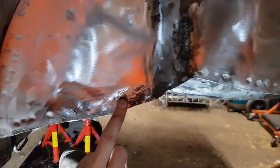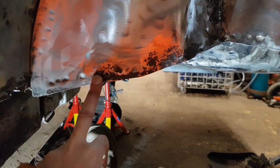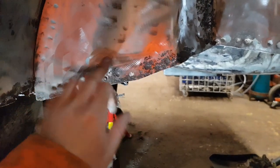I've still got rust up there to tackle. The flap disc does a great job on surface rust — it really eats into it. That's the key difference between the two discs: the flap disc will give you sparks because it's actually taking the surface off, whereas the stripping clean disc, as the name suggests, just strips and cleans the surface. It's abrasive but not abrasive enough to eat through metal, which is what you want when you're stripping.